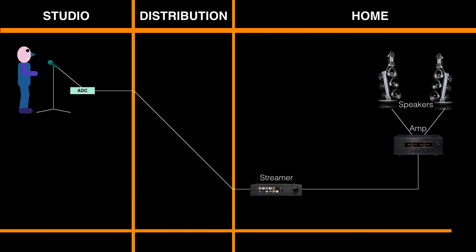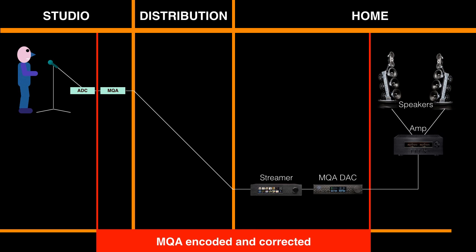Now, what equipment do you need to decode? Well, that depends. With MQA, the fingerprints of both the recording process and the replay equipment are fed to a DSP that tries to eliminate the artifacts caused on both ends. The recording side is beyond our influence but the playback side isn't. In its simplest form, the decoder only takes the DA conversion into account.